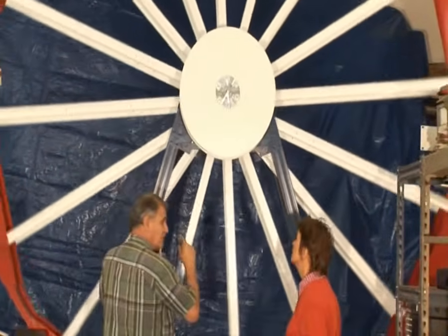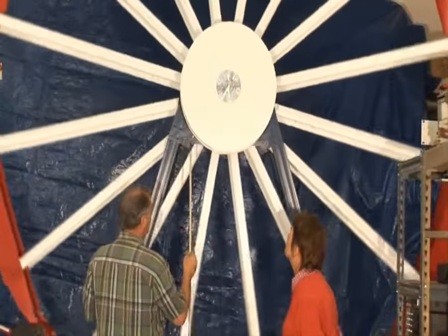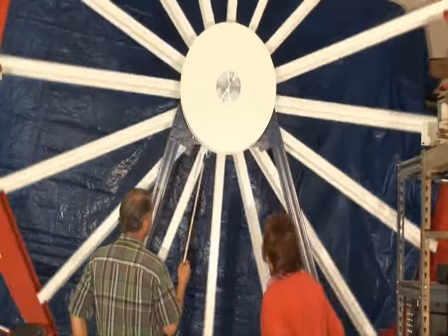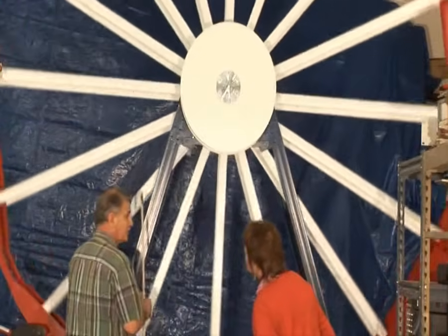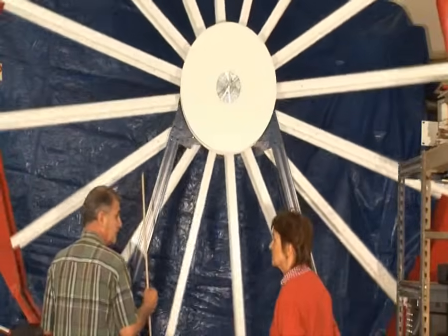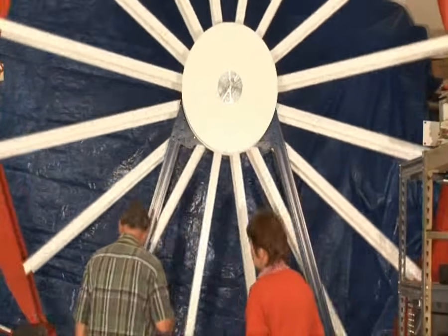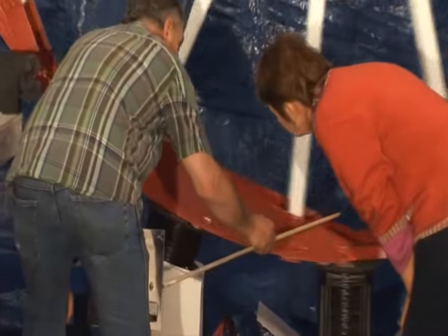It's real sharp. It's a trigger circuit. Inside, there's a disc with 5 magnets on it, and then there's a Hall effect device. This is a switch that Ron Cole and I developed called the Bedini-Cole switch. That's used on all the window motors and on some of the monopoles. It's being used on this monopole because of its enormous amounts of power. So what's happening here, Pat, is here's the current meter, because the big motor is not running right now.